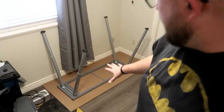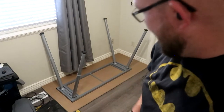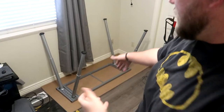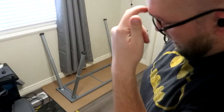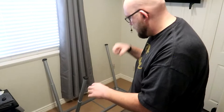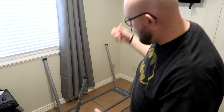Installed that correctly-ish. Because when I flip it over, now those legs are gonna be over there, and I wanted the legs here, and I wanted to just be able to flip it up here, but now I need to shift it that way. And so the old tabletop had screw guides, if you would say, that would protect the wood from being torn out. Well, this doesn't have that, so I have to be very careful when drilling and screwing.